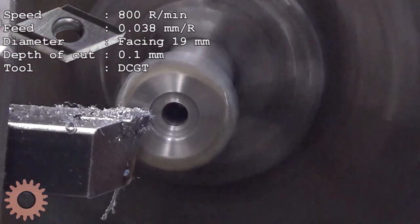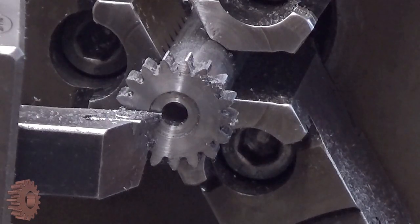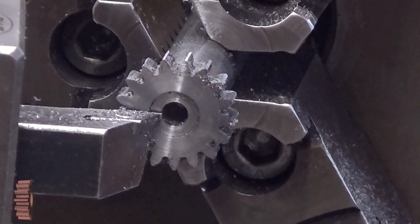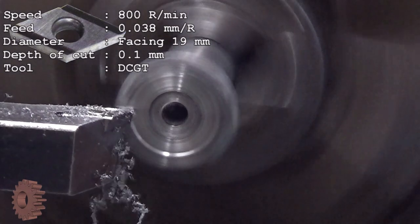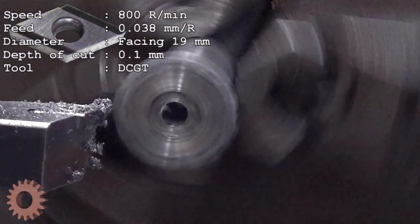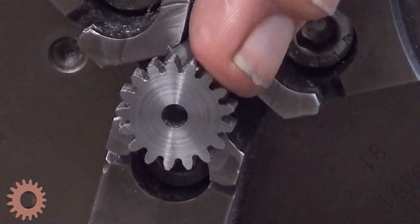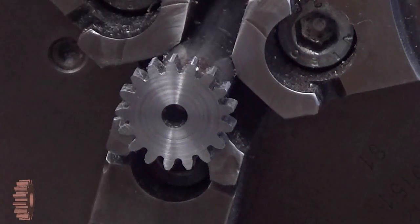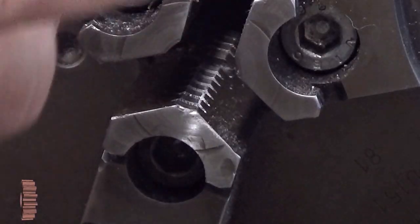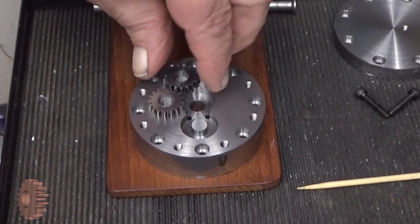Okay. And this time use some oil. Okay, I'll measure it now. Need to dial in the next tenth of a millimeter there, like that. Well, this is now as exactly 5 millimeters as I can get it. And now I just pull it out from there and I have to warm this up to break the bond of the glue. And then next workpiece.